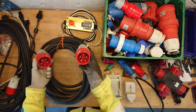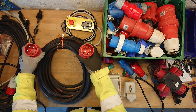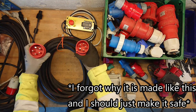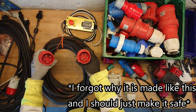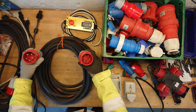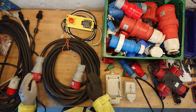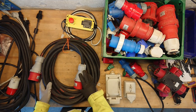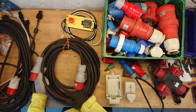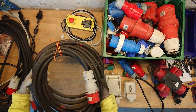Underneath is a 32 amp service cable. This is a special one made for my large Tesla coil — that's why you see male-male in both ends, so this is what you can call a dangerous cable, never to be used for anything else. That's also why it's normally packed away in a box for my Tesla coil stuff. The cable used on this 32 amp service extender is five times 6 square millimeter. So once you get up into the bigger currents, the cable also really gets thick, bulky, and heavy.